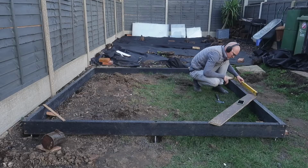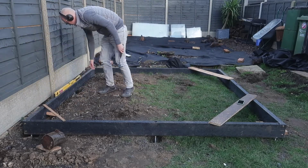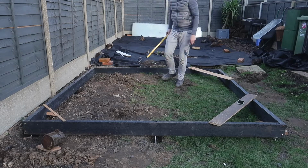With the anchor bolts in place, do one more final check to make sure you get it leveled perfectly. I know I'm laboring the point a little bit, but it is really that important. The base is either square and level or it isn't. If it isn't, then simply keep on adjusting it until it is before you move on to the next step.